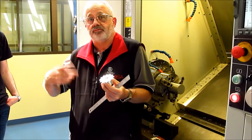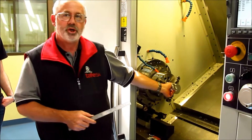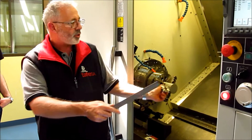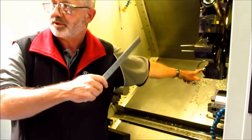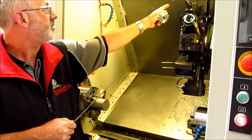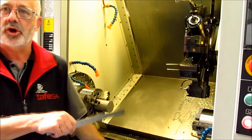So it's set-up time that this triple-axis machine does away with. This will do the whole thing turned on this side — you've got a main spindle and a sub-spindle, they'll transfer the part from here to here. Live tooling means the tooling will spin as well if the tool has that option. These are fixed tools on the lathe; the fixed tool is here, and these ones will turn and they're in two orientations.